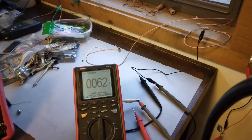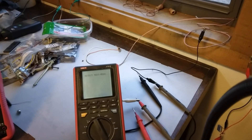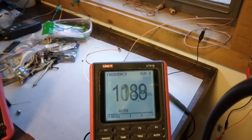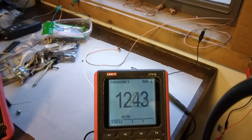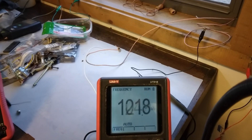What I did before is I kept adding to get a maximum load in the circuit — I kept changing the resistance until I get the maximum voltage with the maximum current. I'll go ahead and switch this over and check the frequency too, because I'm not sure what the source is. It's jumping around — this is kilohertz. I thought it might be a higher radio frequency, because when I had the wires strung out between the house and the barn before, I was picking up an AM radio station on my crystal radio.